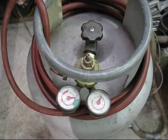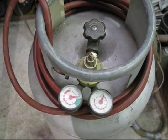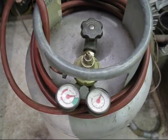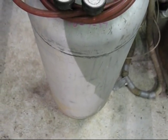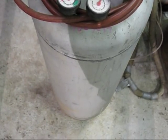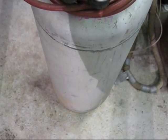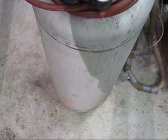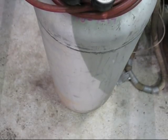This is the regulator I use when I want to melt cast iron with propane. It's an acetylene regulator but I'm using it with propane. This is my preferred method — using a 45 kilo bottle. It does not tend to frost up as easily as the smaller bottles do. But when it's close to being empty, exactly the same problem occurs, so I need to have a full 9 kilo bottle as a backup when this one starts to frost up.